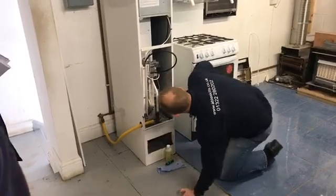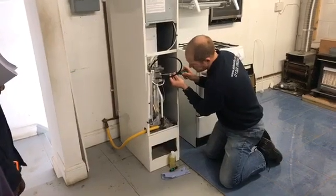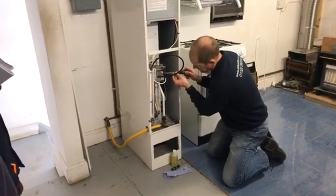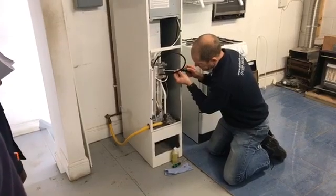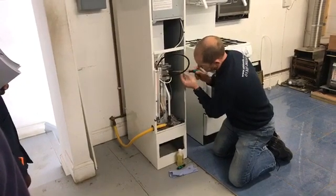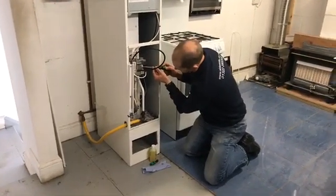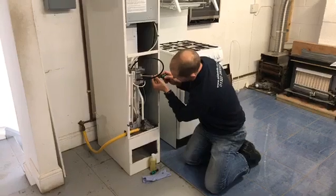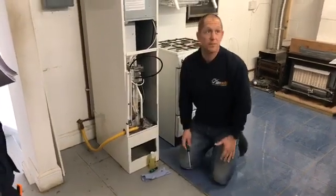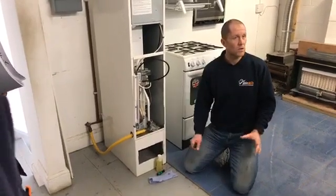Just going to get a good look at that. I'm going to go a tiny, tiny bit more. Not being very responsive - there we go. That is just over 9 millibars. That's as good as we're going to get on a water gauge. Just over 9 millibars - we want 9.2.